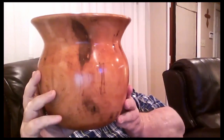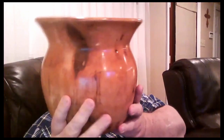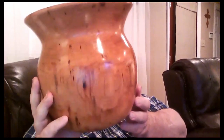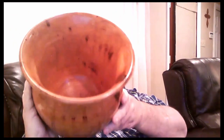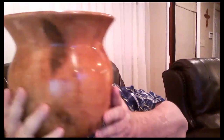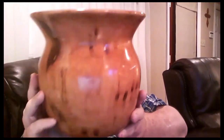This is the piece. Very nice. This is a piece that we did yesterday. That's very good, Ronnie. Very nice. If you was using wipe-on poly or lacquer, you'd still be working, getting a second and third coat on there and evened out. That's just one coat, Ronnie? One coat. And that's the secret. You don't want to put multiple coats. One coat.